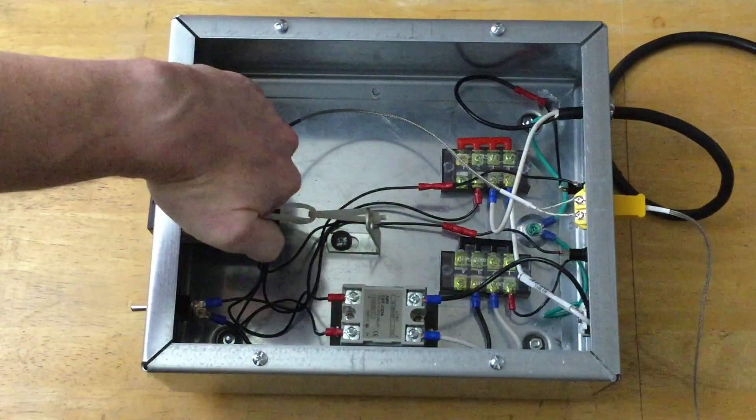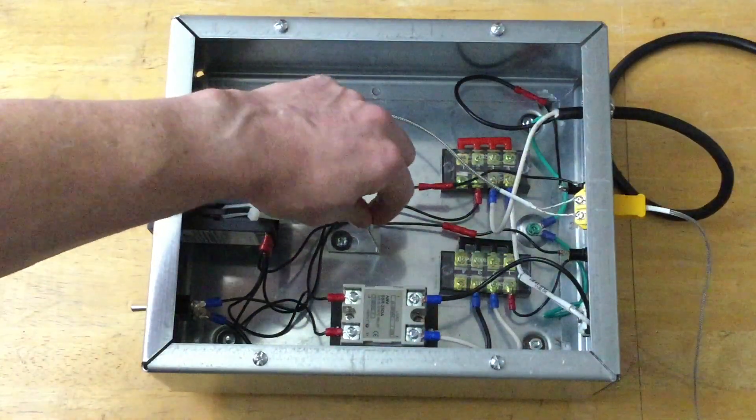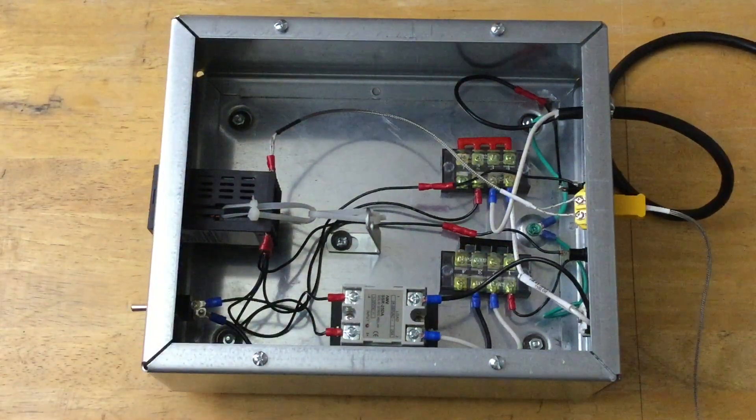I used hose clamps to hold this cord in here because that's what I had on hand. I've got wood feet installed on the box instead of the rubber feet like Johnny used, and I put my thermocouple connector in the back of the box instead of in the front. On the PID controller there are some plastic pieces that are supposed to slide on and keep it tight — I didn't have those, so I put a post in the middle of the box and got creative with some zip ties. Other than that it's almost identical to what Johnny did. If you want to watch me assemble mine, hang around for the next few minutes — I'll turn up the speed and the music. If you want to know how to build your own, I'll put links in the description to Johnny's videos.